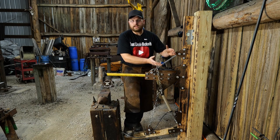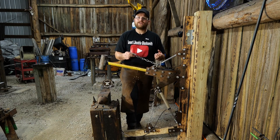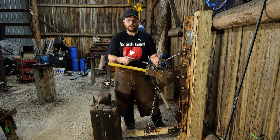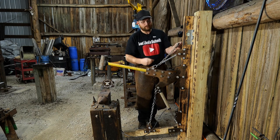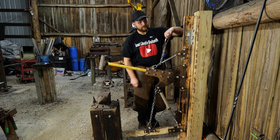Spring tension matters - that's why we have provided and included an adjustment chain. Instead of this being a fixed focal point, we have provided an adjustment chain with multiple links. Don't be afraid to take this bracket and set it up here within reason for your adjustment chain, because you can go all the way out to here and have that spring hooked up to it.